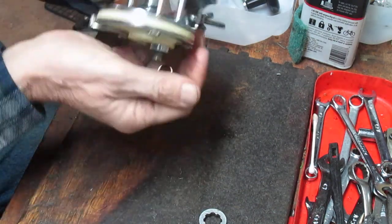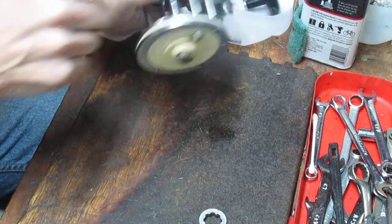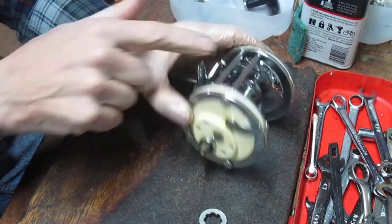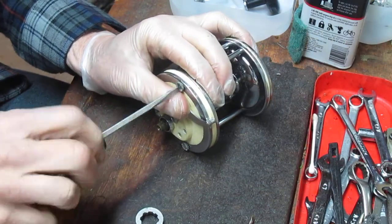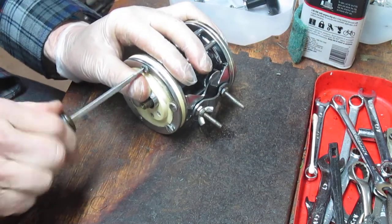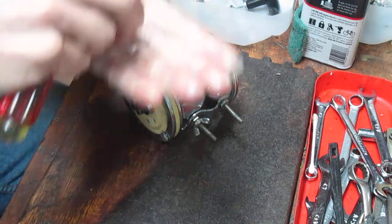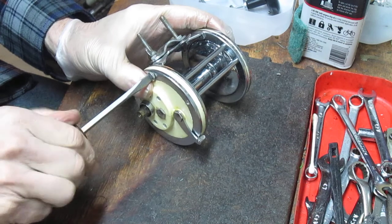As you work on these things, you'll see the quality of the metal — it's really unbelievable. On this side you'll see there are four screws, but if you turn it over you've got two cross posts and the reel seat, totaling six positions. Make a mental note that two of these cross posts don't have screws in them and note where they are — they happen to be on the bottom. I always tell folks: take pictures along the way so you don't confuse yourself. If you're going to take all those pieces off and clean them up, you're going to have a problem if you put the cross posts back in the wrong position. There's also a longer screw and a shorter screw — the shorter screws go in the bottom on the reel seat, the longer ones go into those two cross posts.